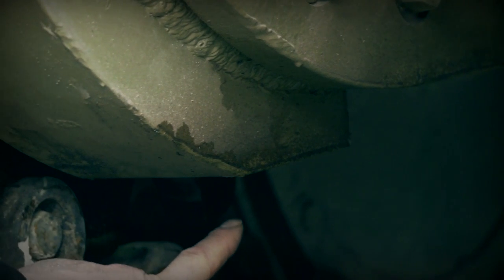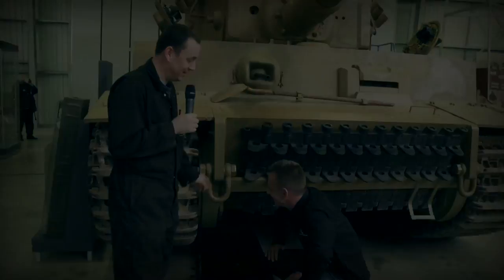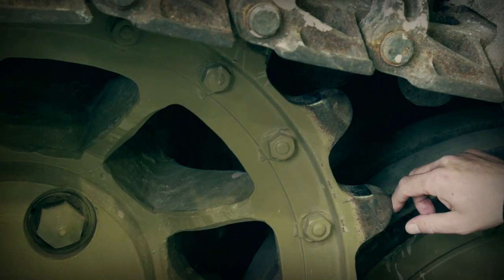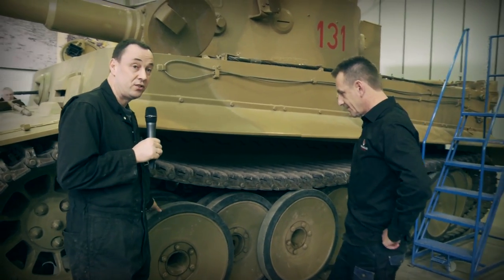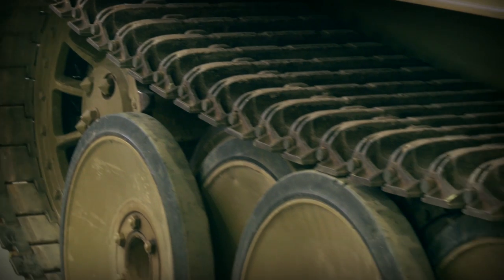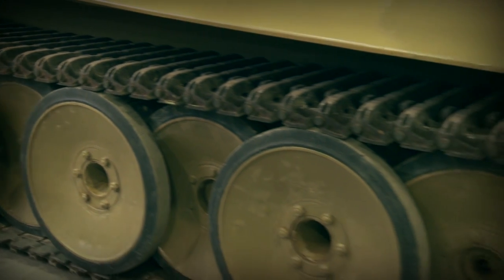What's the drip tray for then? A bit of a leak? You always get a leak, but as long as you check it and you check the right levels, happy days. We check for sprocket wear, any pick-up marks on the teeth — we try to keep an eye on those. Road wheels — every wheel station is greased so that has to be checked and greased up. The rubber on the road wheels, we check there's no more being picked off, or it's cracking or deteriorating. So we keep an eye on the road wheels.